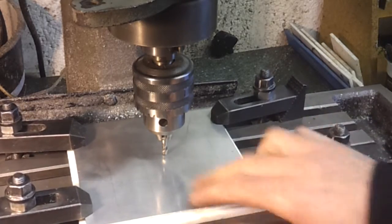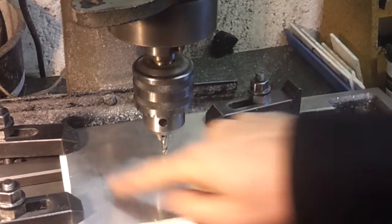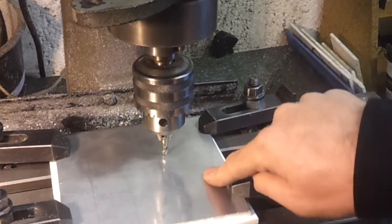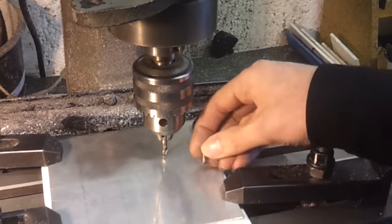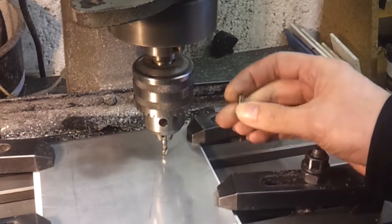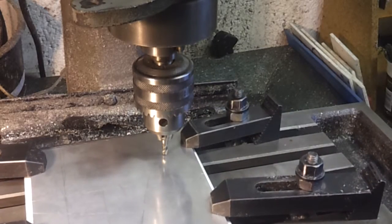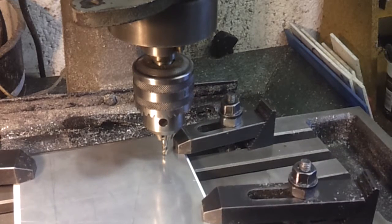This is going to be the surround plate, so I need to chop the centre out. I'm going to start off with four holes for the guide pins in the corners and four sockets for some little magnets — I don't always need to add them but it just helps keep the plates together when the mould's closing. I've cut the sockets just in case. First I'll get those cut and then start work on the centre section.